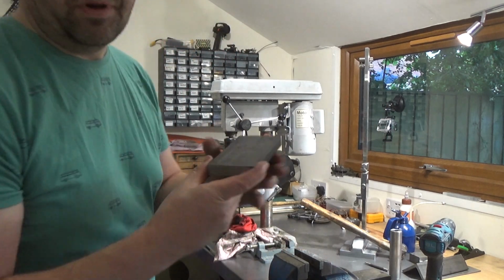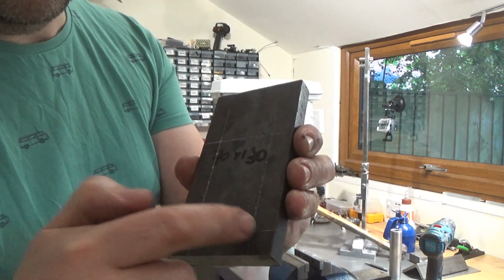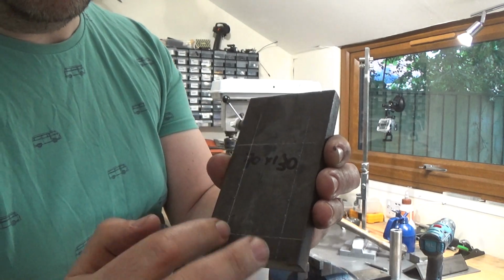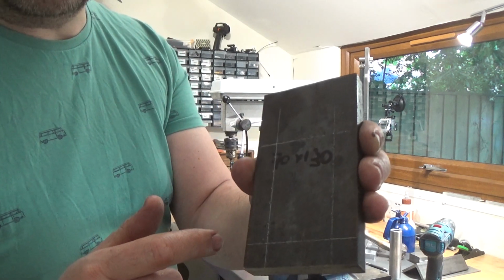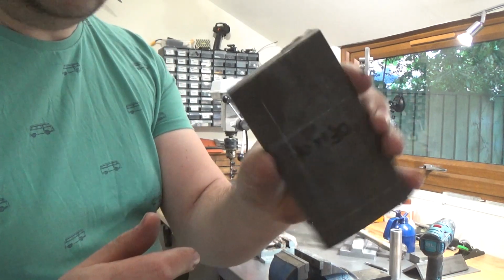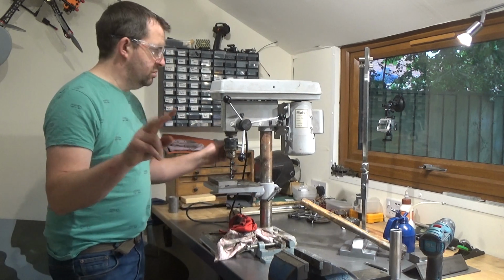I'm starting on the next block, which is putting the slots up here. So I've got the 2 end holes. I'm going to drill first and make sure those are 10mm before I start doing the slot, and then drill out a load of the rest, and see how well that bit turns out. Here we go. Drilling marathon, take 2.